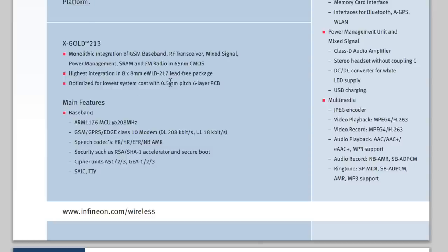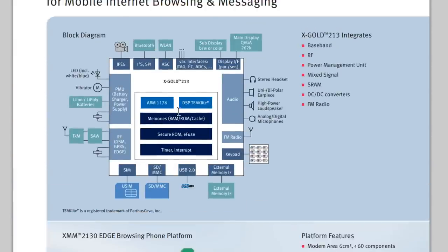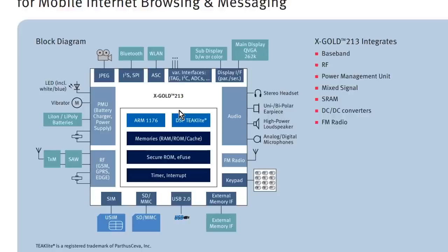Fantastic. And it's a pain in the ass — 0.5mm pitch BGA device. They even tell you it requires a 6-layer minimum PCB just to route the thing out. So you can't just get this on a 4-layer board. Here's the internal block diagram for the thing. And as you can see, yeah, I can probably see the kitchen sink in there somewhere as well. It's got an even secure ROM and eFuse and all sorts of things. It handles the keypad.